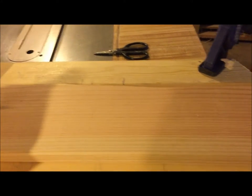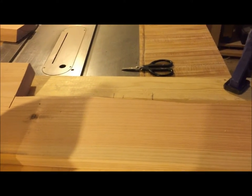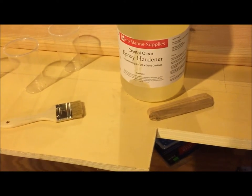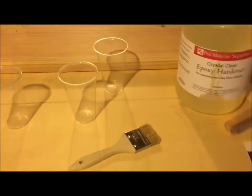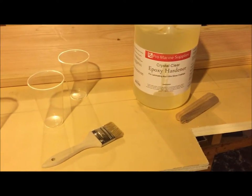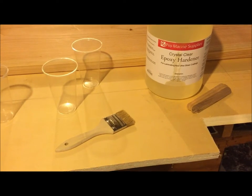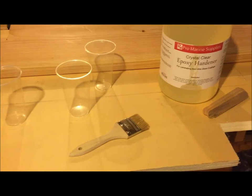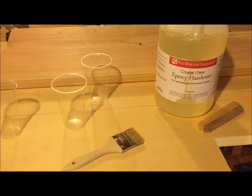What I'm going to do is pre-coat what's left of the 2x10 with a layer of liquid epoxy, and the same with the plywood where I'm going to screw it down. After those are coated, I'll mix up the thickened epoxy — that way epoxy soaks into the wood first and won't get pulled out of the thickening agent, which would leave you with a dryer bond.